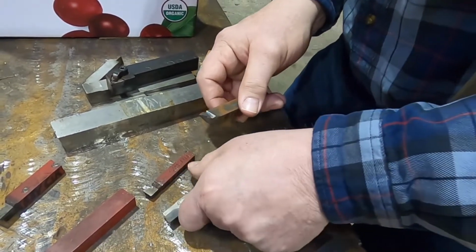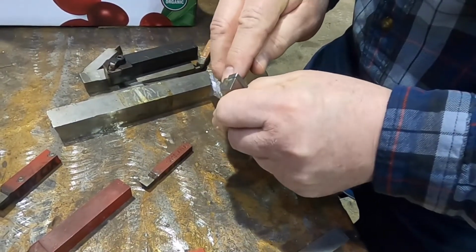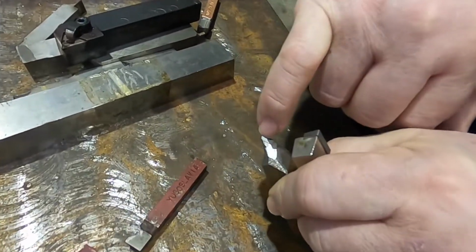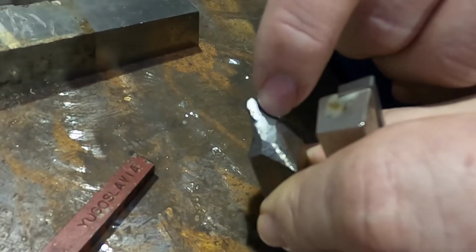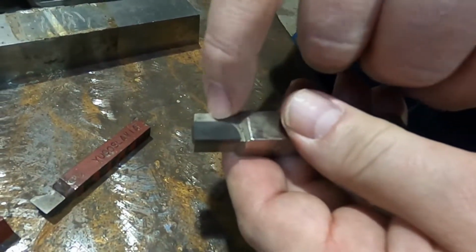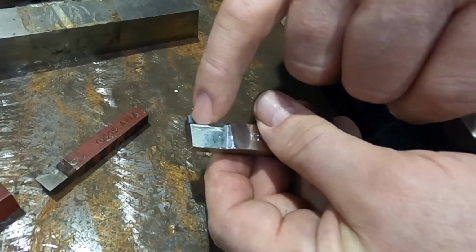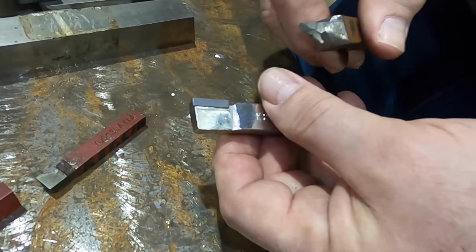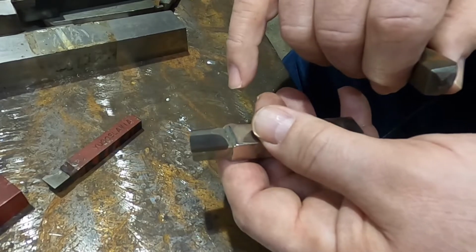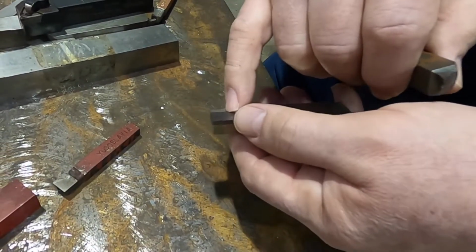Also, as you notice, this carbide here will still hang on, but it doesn't have a lot of area to braze to. What's left where it's brazed, you've got very little area left and a little bit of a shoulder there. When you have a new piece, you have this whole curve. It's milled down slightly so it sets in. Besides the silver brazing, which holds it real good, you have the fact of a pocket behind it. And the pocket behind it for normal cutting will never make a difference.